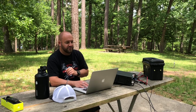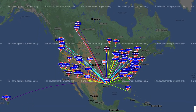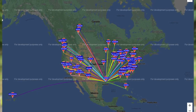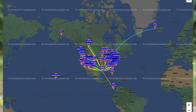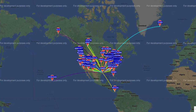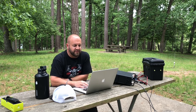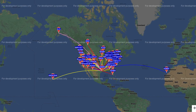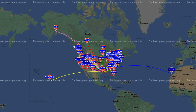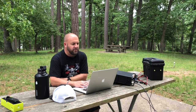Looking at the first transmission with the shorter counterpoise wires, we got a lot more Alberta stations but only Hawaii — we didn't get Puerto Rico, we didn't get Alaska, and it was more just within the continental United States. Then the second transmission with the standard-length counterpoise shows we're back to Alaska, actually all the way down to South America — looks like Nicaragua — again Hawaii, and all the way up to Iceland, which is pretty cool. The second transmission with the shortened counterpoise got Alaska, Hawaii, and also Spain or Morocco, plus again that Alberta station.